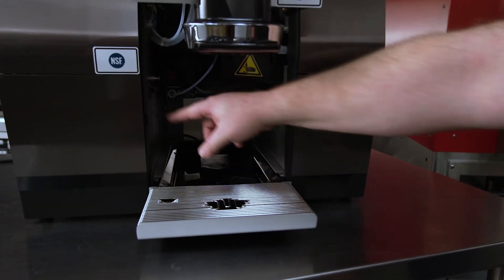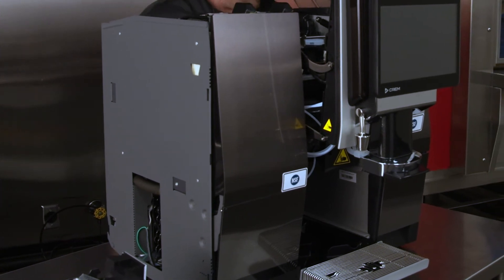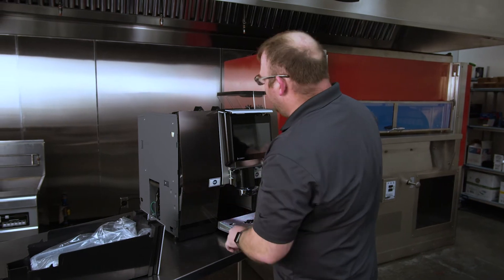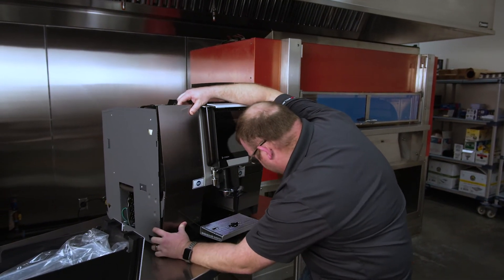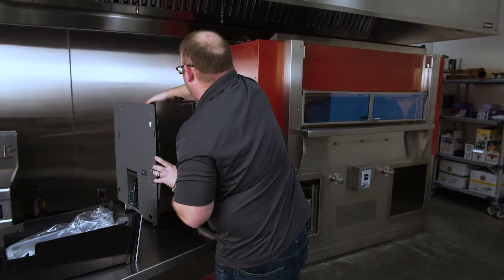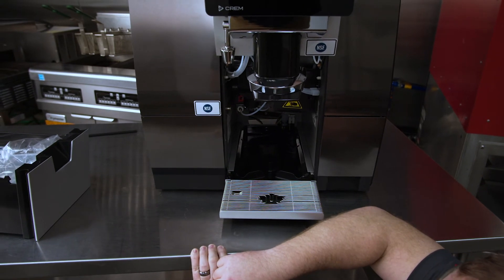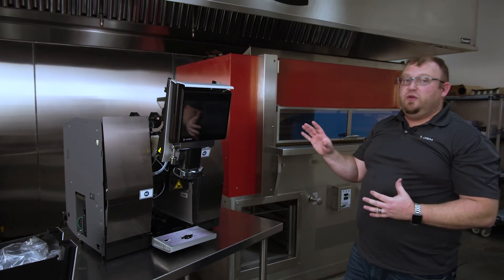You're going to work on the locking pin that is in the front of the machine. Do a second check on the back of the machine to make sure that the lock pin is in place. At this time, so that you do not damage any of the arms or the gears inside, go ahead and lower the screen and then make sure that the machine is aligned. That pin is actually spring loaded, so it will pop down into place once you have seated it. At this point, you have successfully mounted the fresh milk unit to the main unit.